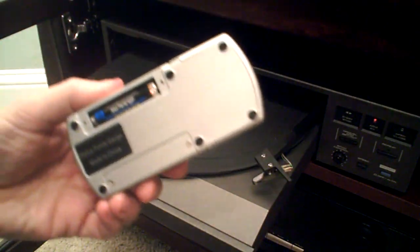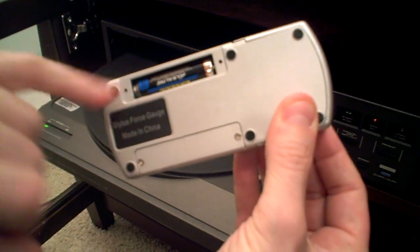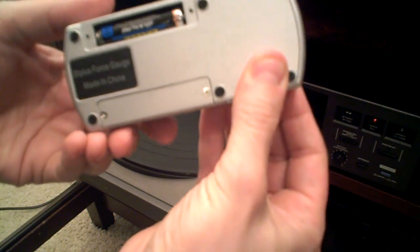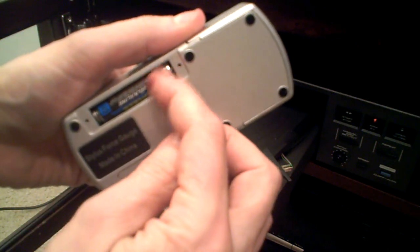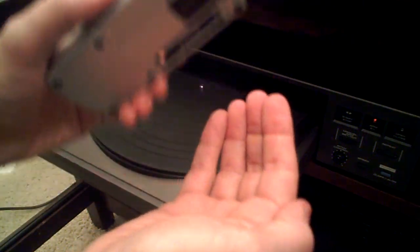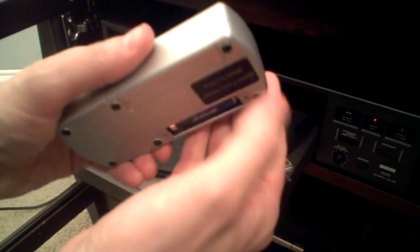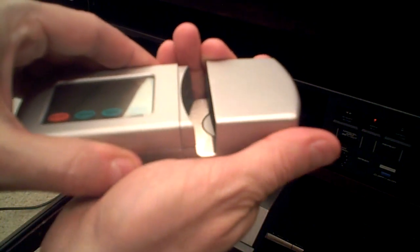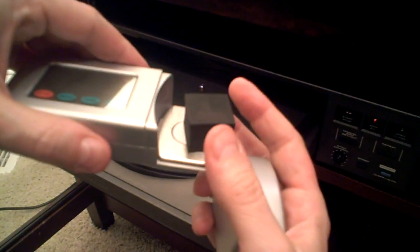We've taken the liberty to install the batteries already — one cover plate is off, one's on, with one battery in each compartment. The screwdriver is for the battery compartment covers. One caution: when you remove the battery someday, try to use a non-metallic tool if possible. Do not do the typical thing and try to hit one hand against the other to pop the battery out, because that has a very high chance of completely destroying the strain gauge inside, which is a very sensitive electronic part.